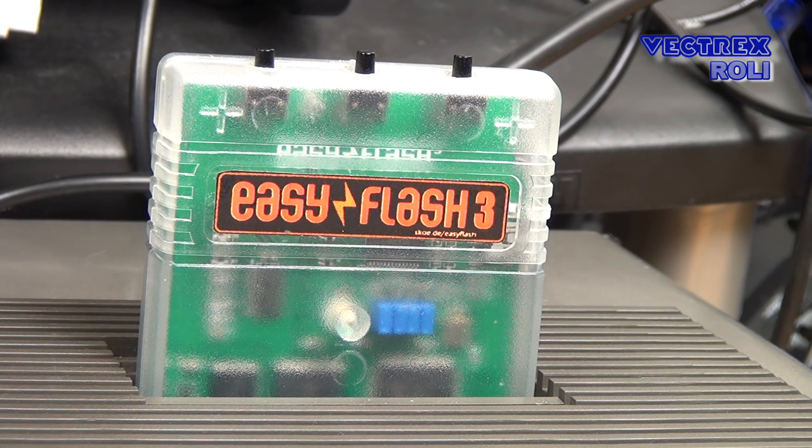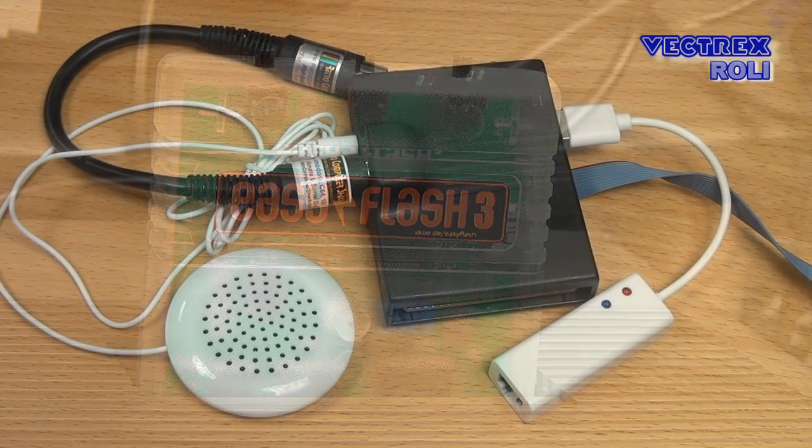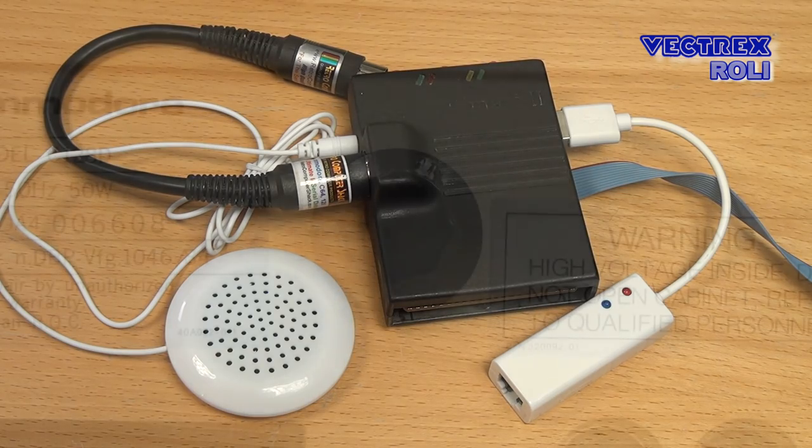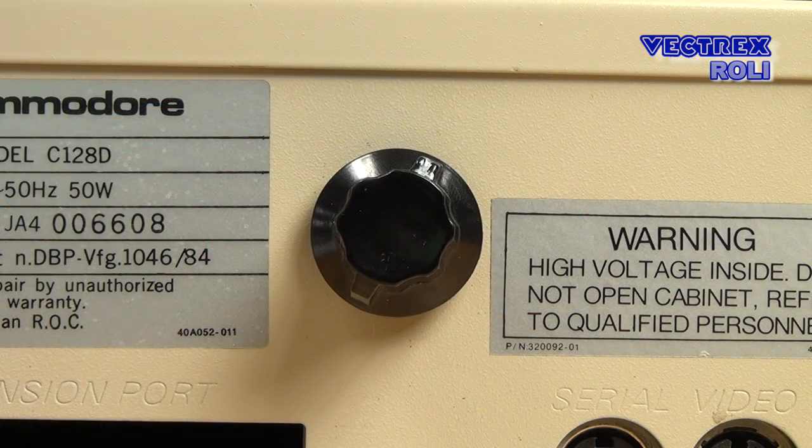That's how I currently load games on my SX64, for example, where I have similar address issues with the built-in drive. I want to use my good old 1541 Ultimate 2 as an external drive replacement on my computer most of the time, so in that case it is much easier switching the internal drive to address 10 first, using the rotary switch, and then using drive addresses 8 and 9 for my external Ultimate drive to emulate two 1541 disk drives. So for this switch mod I had to drill a hole into the case and I put it at the back where I don't immediately see it.